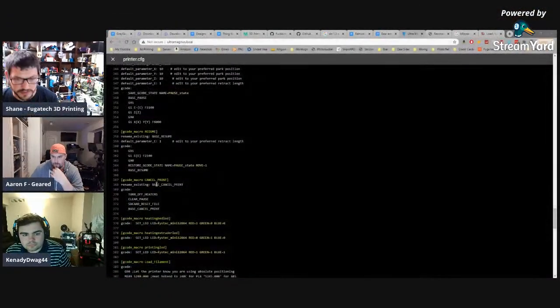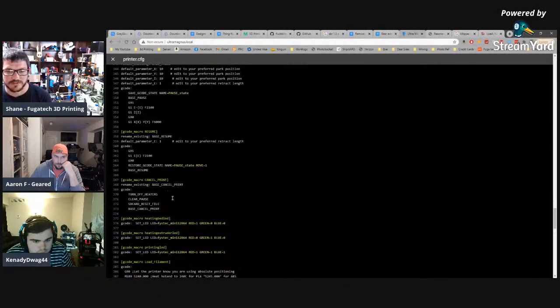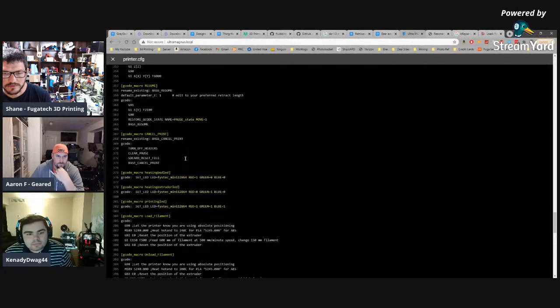Yeah, so let me pull this up real quick so you can see it. So cancel print just does this. Turns off the heater, clears pause, resets the file, and cancels the print. Okay. And that's for the cancel print macro. That's not for the cancel button. Yeah, so probably the reason why I never ran into that is because on Mainsail, in order to cancel the print, you have to pause the print first. Okay.